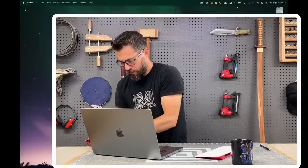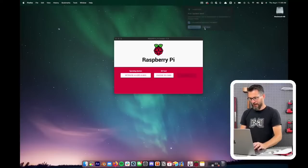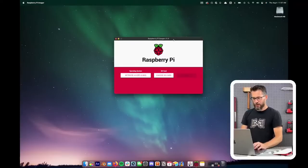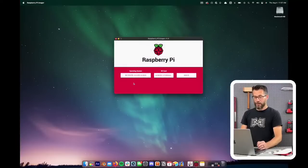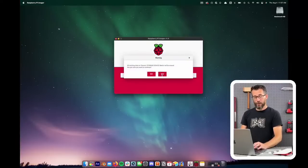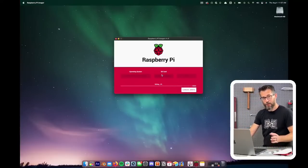There's a Raspberry Pi Imager tool, and this is a free download from Raspberry Pi. You basically just choose the card that you want to format, and then there's a list of operating systems. It used to be you had to download them and pick the right one. Now you just select the one that you want and hit write. It's going to erase the card, which is fine. And that's it. So see you next time. Thanks for watching. I'm just kidding. That's really all there is to it. That puts the operating system and everything it needs to run on the card.